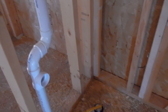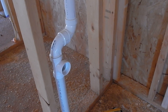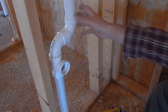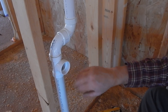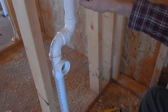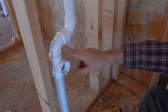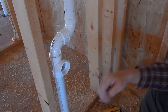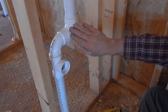I have this small bathroom — it's a half bath downstairs of a two-story house. I'm putting together these fittings here. This pipe is where the trap is going to be from the sink; it's going to come in and drain down. This part is the vent, and each drain line that has a trap has to have a vent in order to let air in so it doesn't pull water out of the trap and let sewer gases back into the house. So I've got three fittings that I need to attach.